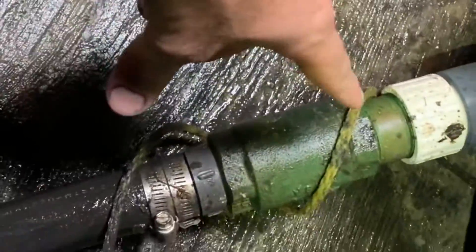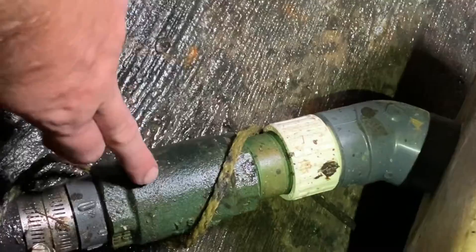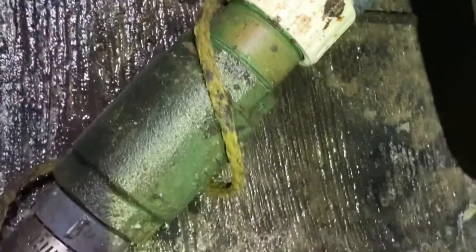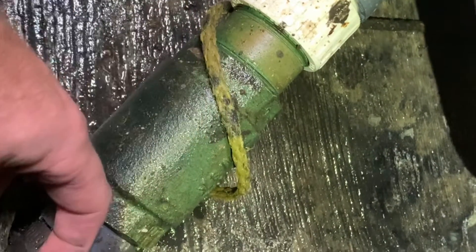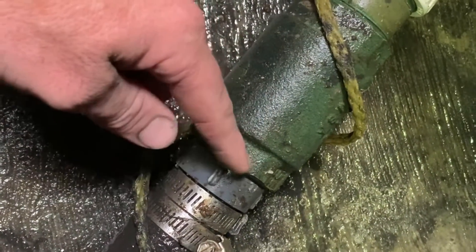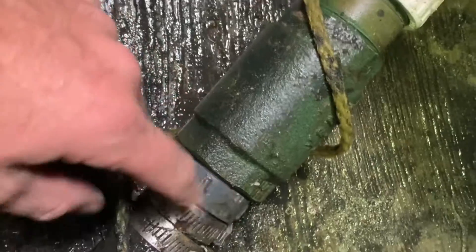When you're in the tank, it's also a good time to check the check valve. Since they use a jet pump inside the house, the jet pump needs a check valve at the bottom of the suction line. This setup is: floating intake filter, check valve, water line feeding into the house. Do a visual inspection of the check valve to make sure it looks tight with no leaks. If this check valve leaks anywhere from the intake filter to the pump, that pump will not be able to prime and you'll get it cycling continuously.